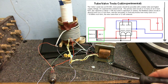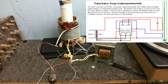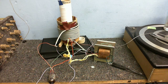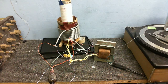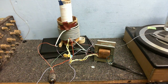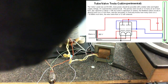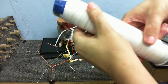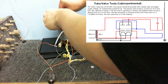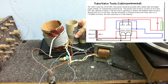This is probably the simplest Tesla coil I've ever made. All it is: we've got a transformer here, a valve there, a few capacitors connected across the primary coil. There's the primary, the secondary, and there's a feedback coil in the middle. I'd better just turn this off so I don't electrocute myself when I take this apart, so you can see what's actually in here. And there's no rectification either — the whole circuit's working on AC. So, this is the secondary. It's a little bit warm right there — I don't know why. The rest of it's cold, but that's weird. And we can move this out the way — there's my feedback coil and the primary. And that's it.